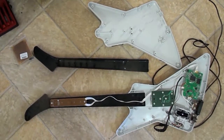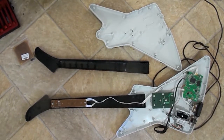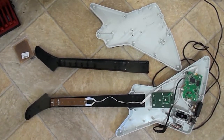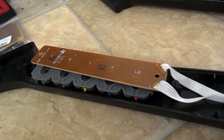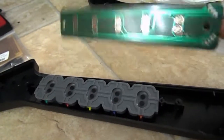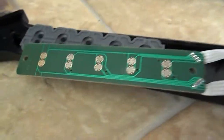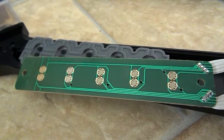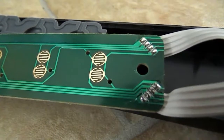The white-bodied guitar is the newest and the fanciest of the bunch, but it still has the same basic configuration: three PCBs and a whammy bar. The cording board on this one also has an interesting circuit with two touch points in each cap. This could be fun to explore — I'll need to decode it, but I think this might be a little routing magic to give additional capabilities.